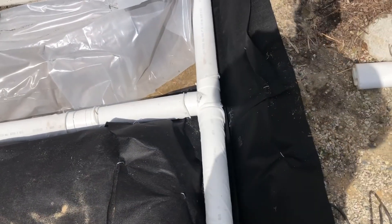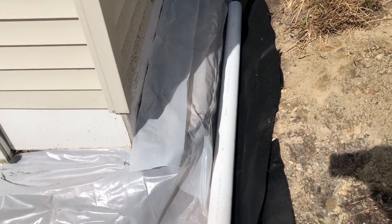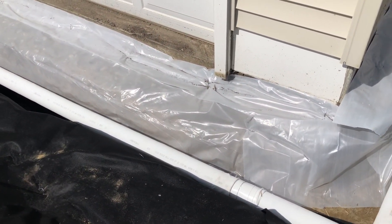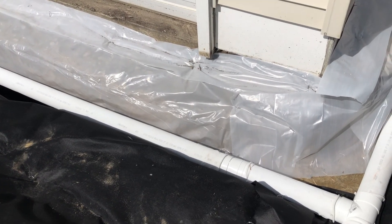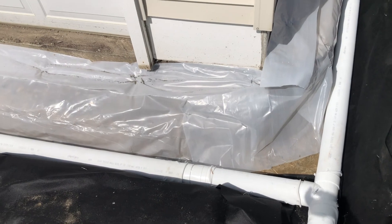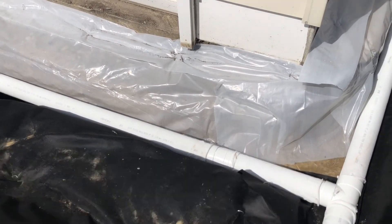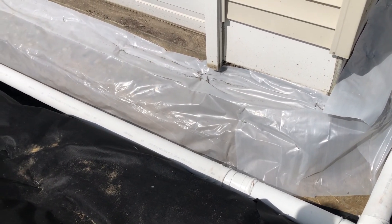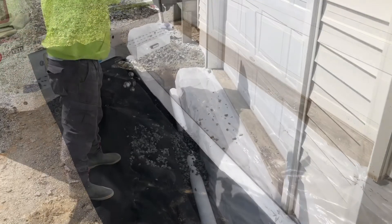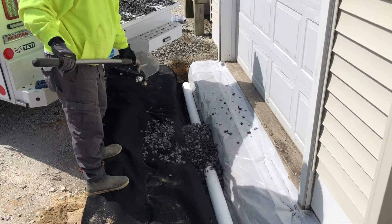You want to have the holes down. There's a misconception that the holes go up — that is not correct. Otherwise you'd have to have over four inches of water build up before it would actually go into the holes and move where you'd want it to go. And if you think water can just drop into those little holes, it's not magic. So yes, you put the holes down so the water can always facilitate through, and when it's not moving it can actually be draining into the soil.